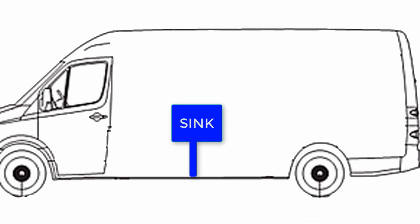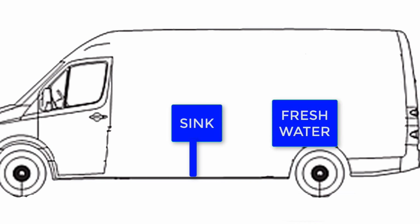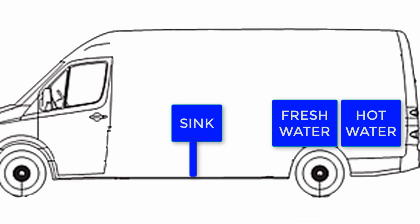On the left hand side of the van I've got a 30 litre fixed water container. Then just behind that there is a 12 litre hot water system. This is 12 volt to 240 volt, and it's all powered by a Shurflo water pump. Now this provides us with enough power to have a shower, and also enough to wash the dishes and such like. The advantage of having the water system like this is that you've only got about 30 litres of fixed water, so it makes you think about using water. It makes you a bit more water conscious. Now I'm just going to show you everything in situ.